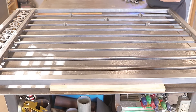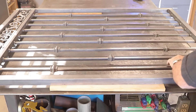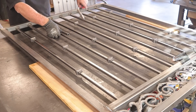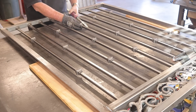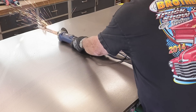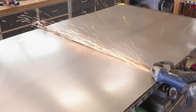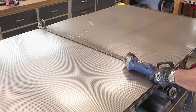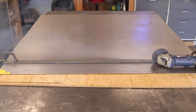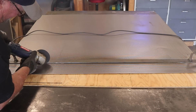Once the break was over, it's time to put the half-collars on. Pretty cool — basically the same thing. You can see I'm just using a spacer piece of metal to get all the collars welded in position. Here's the privacy screen — I found the best way to cut it is with a thin cutoff blade on my angle grinder, with plywood backing. A little smoky, but it works out good.